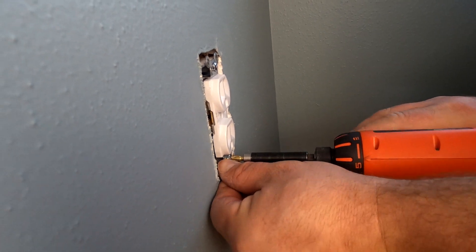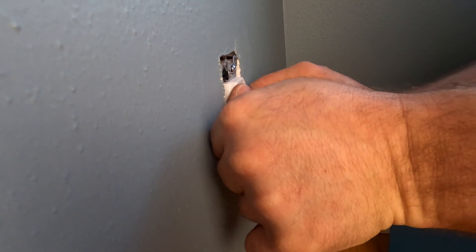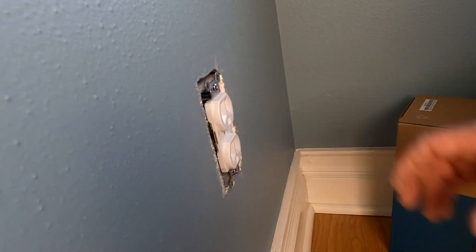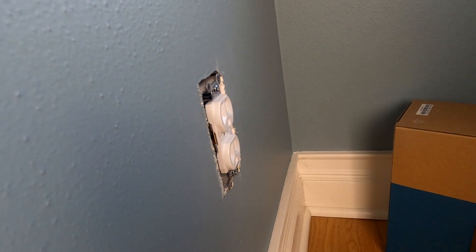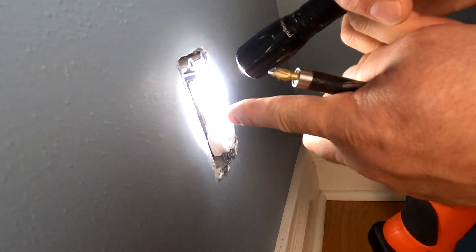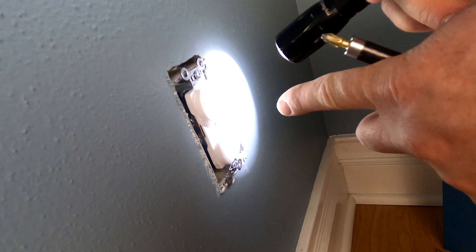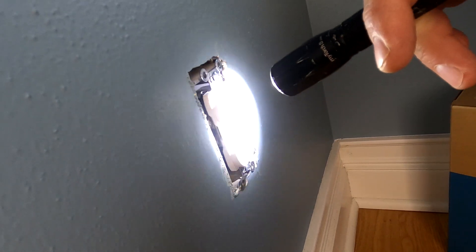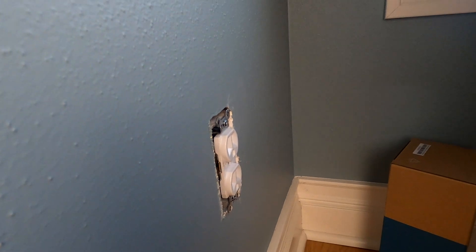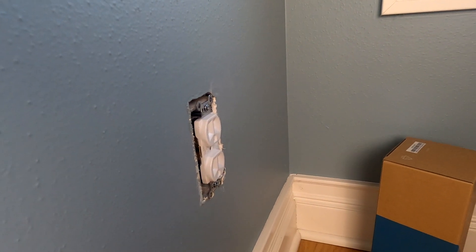Visually inspect it — tip it to make it straight for the outlet cover, move it as needed, secure it down tight, take a flashlight and look inside to make sure nothing is binding, cutting, or pinching. If everything looks good, you're all set. That's how easy it is to replace an outlet — we'll see you in the next video.